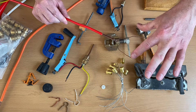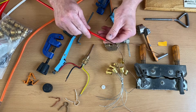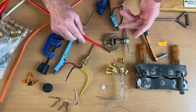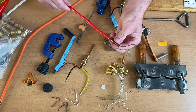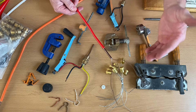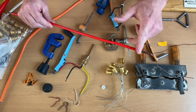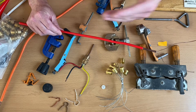So 2 - in this case is the number of conductors. You're going to have considerably more than 2 conductors, but at college you'll likely be working with either a 2 or 3 core mineral insulated cable. The next was L - L stands for light gauge. The actual copper cladding here, which is often used as our circuit protective conductor, is of a light gauge. It can be thicker and be a heavy gauge. It's solid drawn, so that's a solid copper outer sheath on this cable.